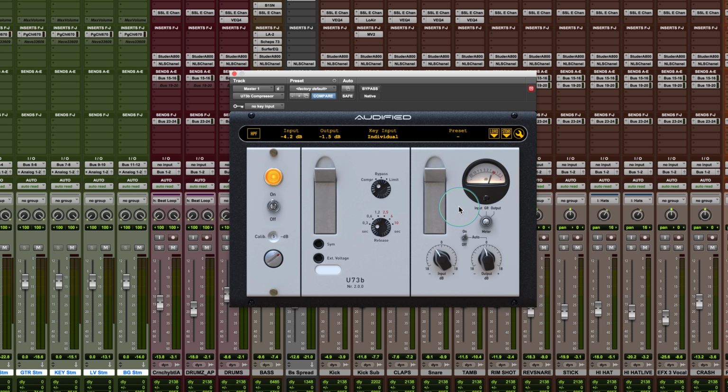One of the things that's unique about this, compared to a lot of tube limiters, is that it's very fast for a variable-mu limiter. That's because it has a feed forward chain, where a lot of times there is a feedback cycle on the gain reduction, taking the output of the signal as it's passing through and feeding it back in to determine gain reduction. The feed forward circuit splits the input signal, and that input signal becomes the trigger signal for the gain reduction. That ends up making it more responsive. So I think that's a big part of what's going on.